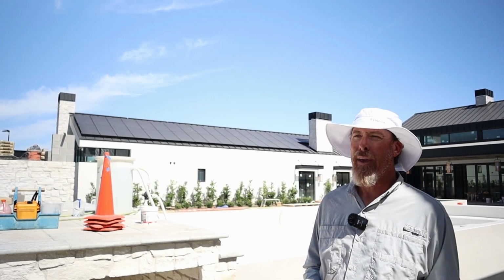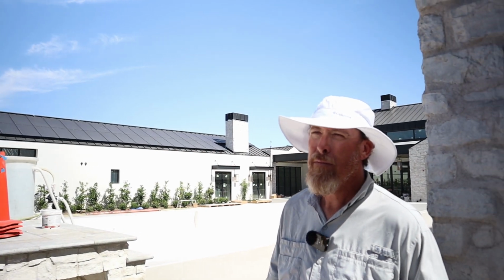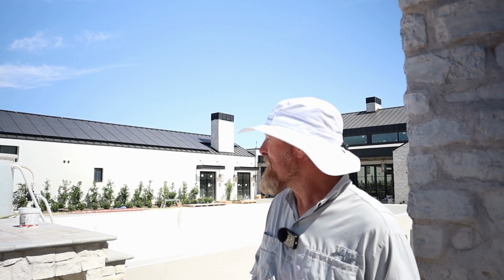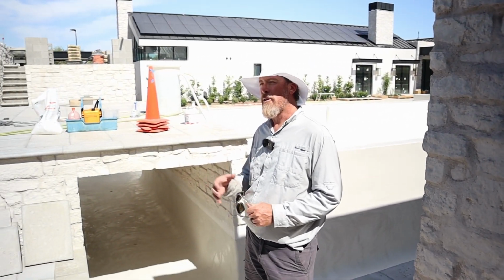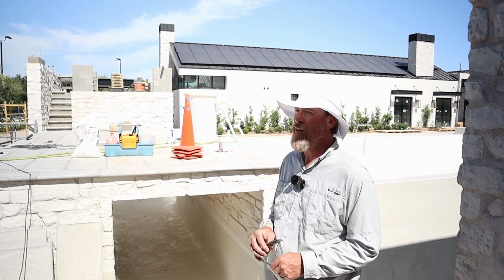And then a couple quick questions. If you had any advice to give your average pool owner, what would it be? That's a loaded question. I would say, once a pool is full, with a lot of pools I see heavy CYA in the water, which is from trichlor. Just keep chemicals lower. A lot of chemical products can be taken out of the pool equation. So really simplify the water, making sure it's balanced. If the water gets hard from either calcium hardness or TDS, try to lower those levels. You'll have better success balancing your water and actually having better water that's more friendly to swim in.